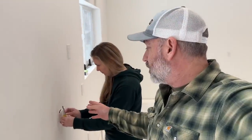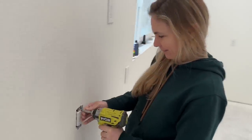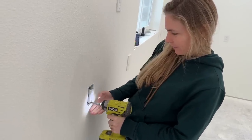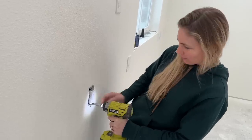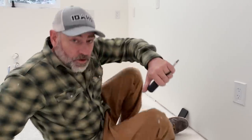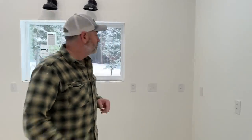One other small thing I forgot to do was put a GFI at the beginning of the run. So Jules is popping this outlet off here and we'll replace it with the GFI. But I'm not 100% sure this is where the home run started, so we'll test that first before we actually change out the outlet. We needed this 20-amp for the outlet that we just found.